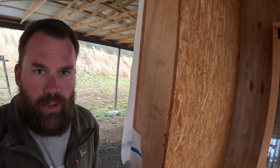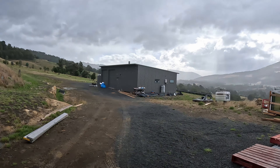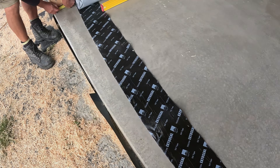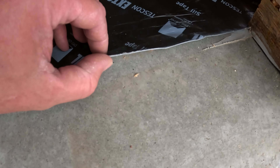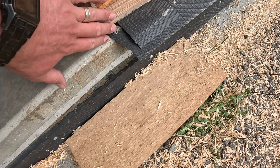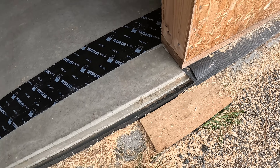Reasonable day today, looking forward to punching some more windows in. I'm going to go and put my feet up, see you in the morning. So here we have a sill tape — it's a squishy butyl material, a couple of millimetres thick. It sits on the sill and it's stretchy enough that it folds around the corner, so we just run it into the corner and up. It folds around the corner and down on the face and the slab.